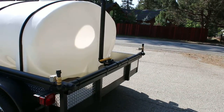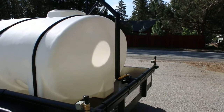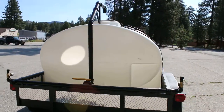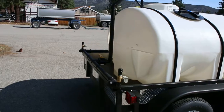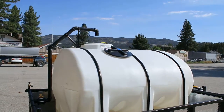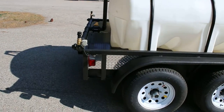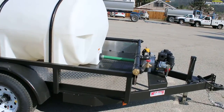This one also has the upgrade of the two-inch galvanized hydrant filler integrated. The all-steel construction is pretty important — the PVC typically used across the industry is not only cheap and substandard but it's also dangerous. If you fill off of a high pressure hydrant, the PVC tends to shatter and fly in deadly shards, which is not something you want to be standing around or have your employees around.